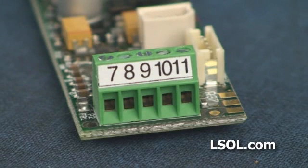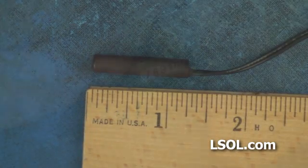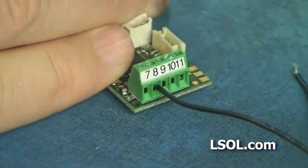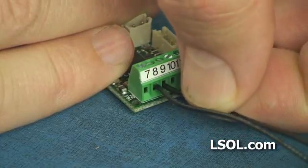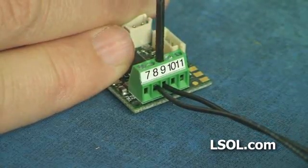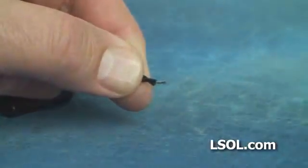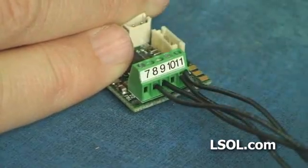At the other end of the board you'll find a connector labeled 7, 8, 9, 10, and 11. This is where you can attach switches to trigger some of the features of the board. The kit comes with a couple of reed switches with two wires. One wire will attach either to port 7, 8, 9, or 10, and the second wire will attach to port 11. We're going to attach two different reed switches — ports 8 and 9 — to affect the bell and the horn. Then we'll take the second wire from each reed switch and combine them together to go into number 11, which is the ground for triggering the events. You can trigger up to four different events and they're programmable using the computer interface.